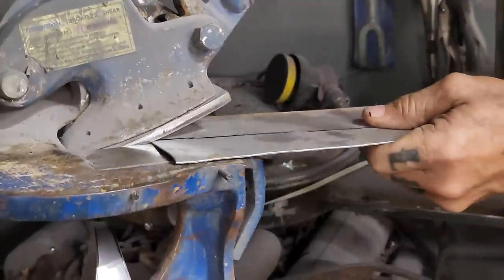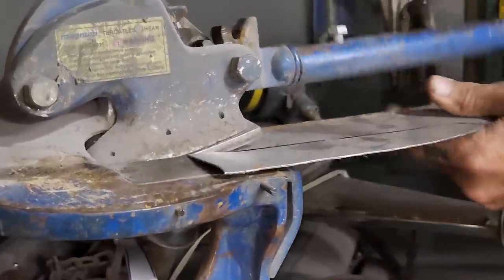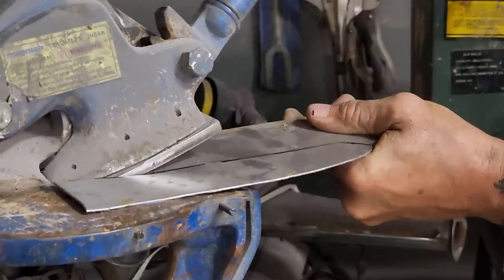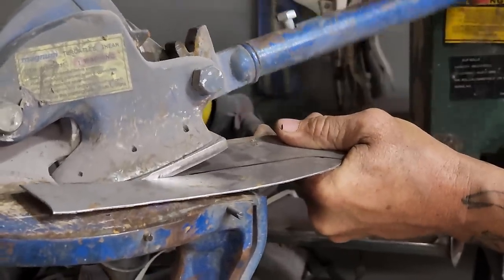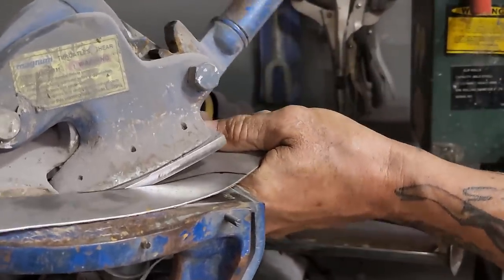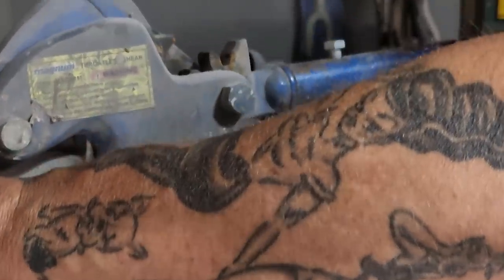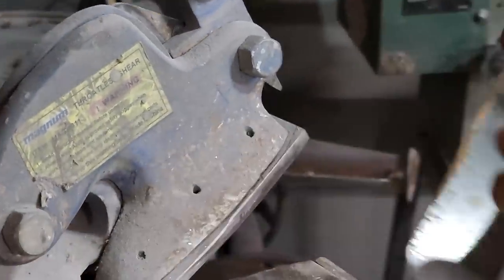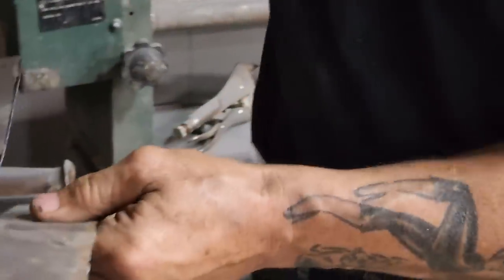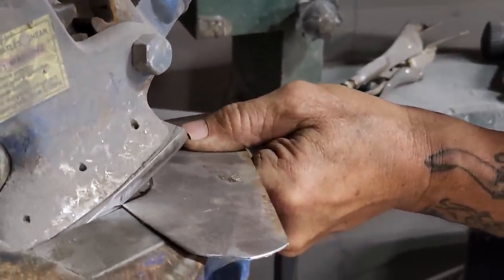Just round it at the corner, because I told you of the situation where two points come together. Generally, your metal will warp. When you cut your door handles off and you go to close the holes in, because you don't want door handles in, I suggest that you round the corners on the piece or it'll warp on you. How do I know? You'll have to ask yourself.